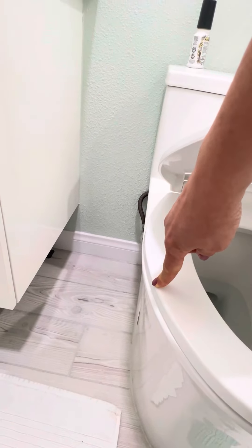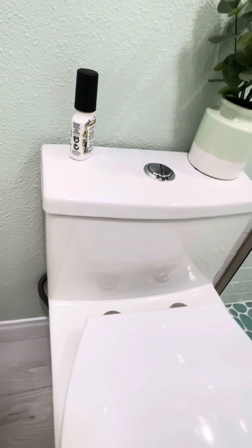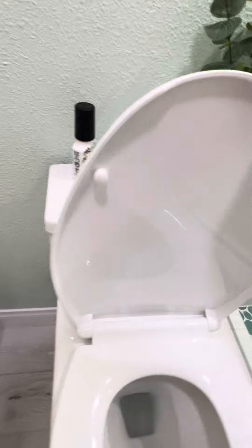It is 27 inches from the wall to the edge of the toilet. Make sure that the water valve is at least 7 and a half inches from the center of the flange, because otherwise you won't be able to reach the valve. This one is 7 and a half inches from the center, so just keep that in mind. And I'm going to show you how it flushes.